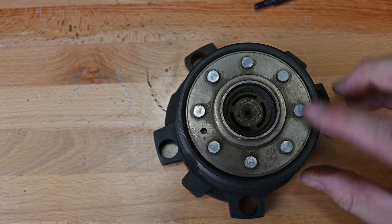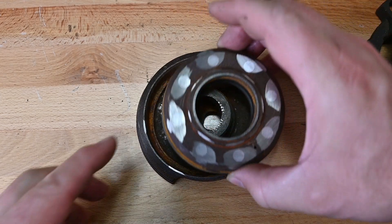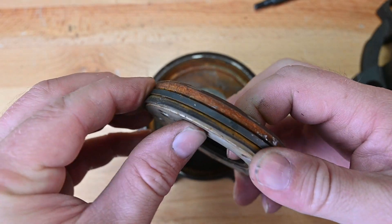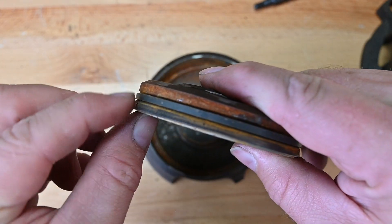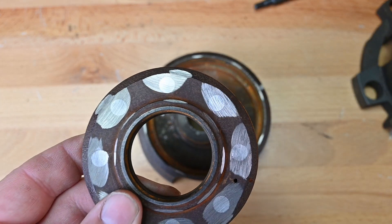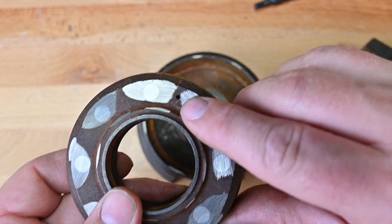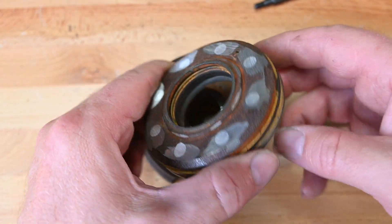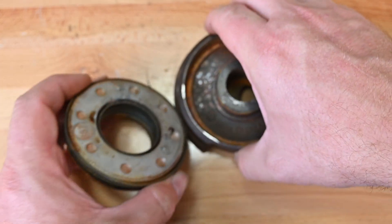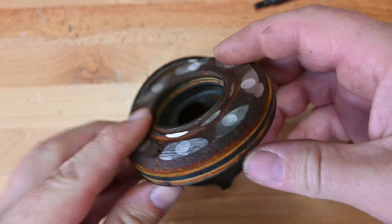The thing I do not know is this piece right here — this ring. I'm not sure what this ring does and I haven't been able to figure it out. In this other one I took it apart and removed this top piece, and in this top piece there's a piece of rubber — this whole edge is rubber or some type of material — as well as this little ring right here is rubber. There are also two gaskets that seal this, and this piece just fits inside. I tried grinding the rivets off to separate these panels but I couldn't get them apart. I do see a factory pressure port here — something to do with high pressure or low pressure. Maybe this is part of an unloading effect — maybe it allows it to unload instead of breaking. If you guys know, leave me a comment because I'd be curious to know what this does.